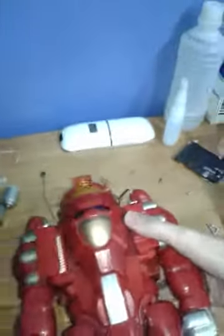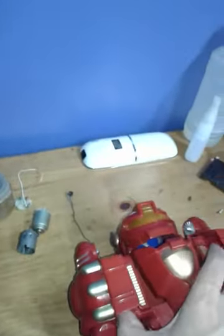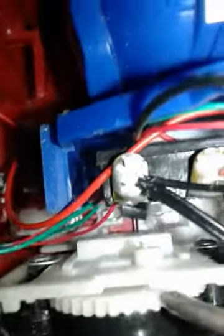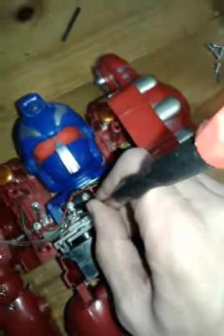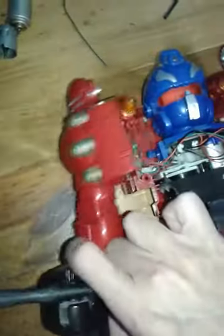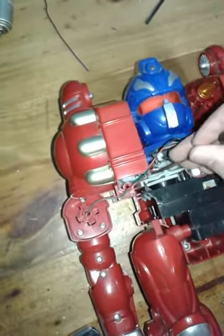The robot actually has two motors. I'll go ahead and show the entire system right now. You take the chest piece off and the arms instantly come off because they are held in by a square fit, same with this one. What you see right here at the front is basically one motor - this motor is the one that controls the walking. The little gear gets in between these two plastics right there in the back where there's a spring. If I put my screwdriver in between those and move it to the side, this one opens up, same with the other one. That's how they both open up at the same time.